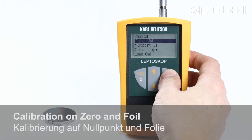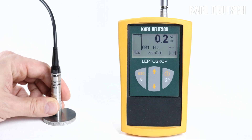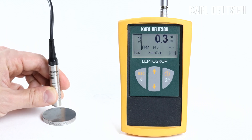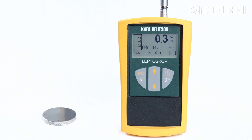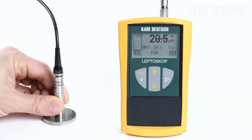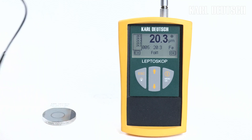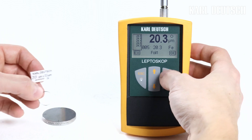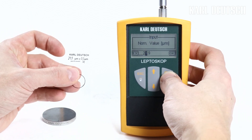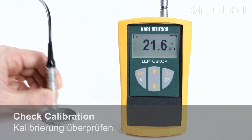For example, the calibration zero and foil. Again we perform a zero calibration by first taking a number of readings on the uncoated reference part. Confirm with OK. Then place a calibration foil on the reference part or switch to a point on the reference part where the exact layer thickness is known. Record a number of readings and confirm with OK. Now enter the nominal value of the layer thickness at the measuring point and confirm with OK. Check the result of the calibration at a point with the known layer thickness.